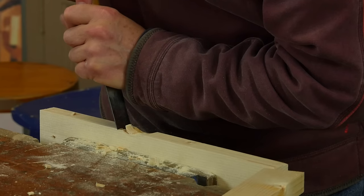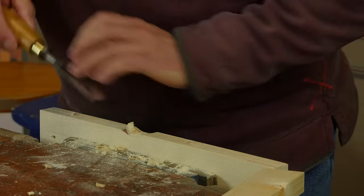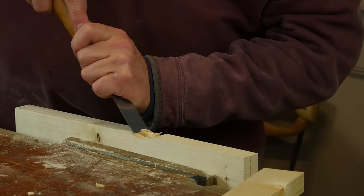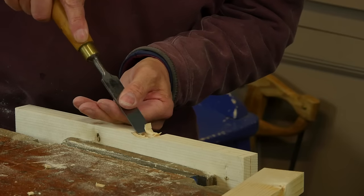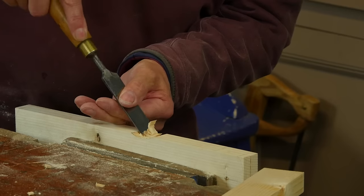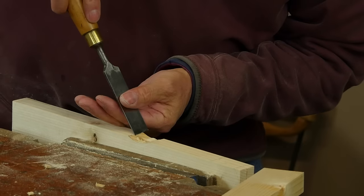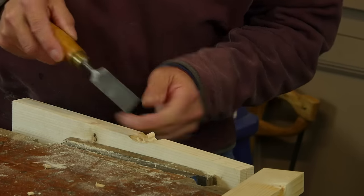Now this is quite soft wood, so you may at some point after you've made this frame saw, you may want to choose a harder wood, or you may want to choose a harder wood before. The idea of using spruce or something like that is the weight and strength. I think spruce may be the strongest wood per strength weight ratio of any wood in the world. So now somebody will probably correct me, but I think it's pretty close to that.